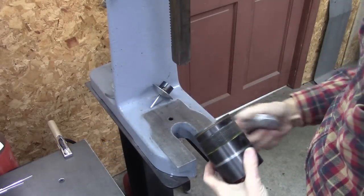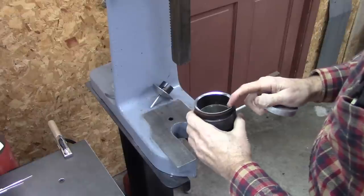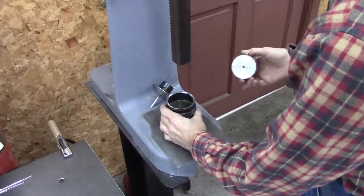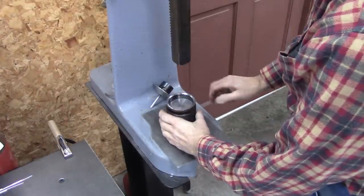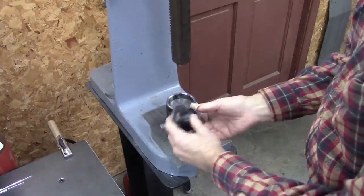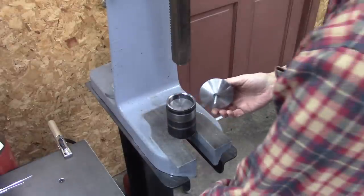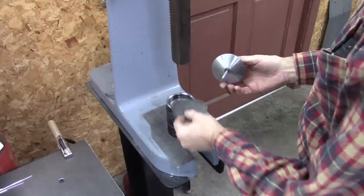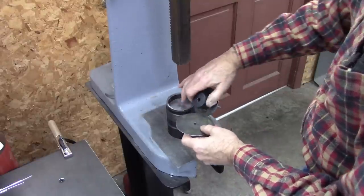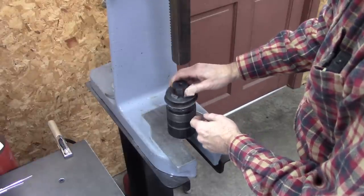You saw me drilling that in the lathe. I've got what used to be some kind of pump tube, and I beveled the edge right here — it's got a ledge inside, and that's what I was making this aluminum disc for. It sits right in there. I made a cone-shaped thing on the lathe, welded a big chunk of steel on there just to grab it in the lathe, and I'm going to form a cone with that. I've done a couple without this guide, but it tended to want to move to one side or the other, so that should fix the problem.